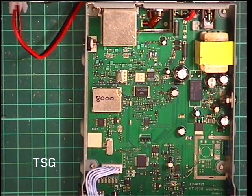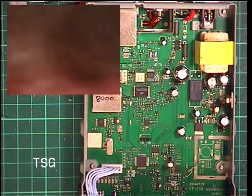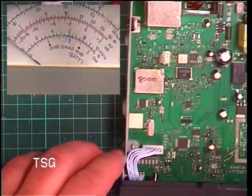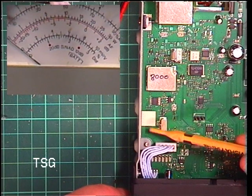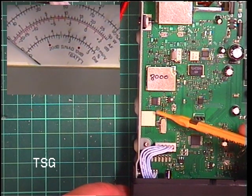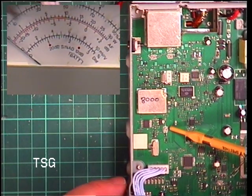So we'll start with transmitters — we always do. I'm going to set all three up but it's going to be pretty quick because there aren't many adjustments. What's it doing straight out of the box? There's no trimmer capacitance — it's a bit like the UniDen 100, 200, Realistic 2001, all those chassis which have no adjustment. Unless that potentiometer is — which I highly doubt. So we're going to go into transmit.